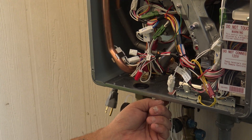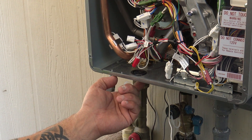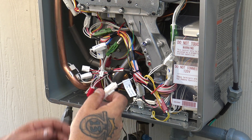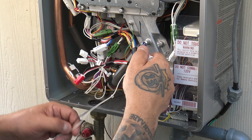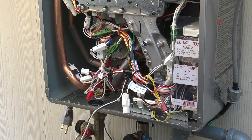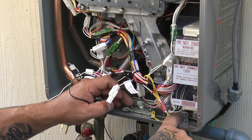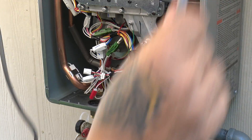This knockout here is for the power, and this other rubber knockout is for the low voltage controller wire. The wire comes in through a rubber grommet, and it's a black and white wire that wires into the back of the PC board, which has a transformer that steps everything down. You're going to use these two wires and ground it to the chassis — and if you notice, there are ground symbols on the chassis. It's very important to ground the unit.